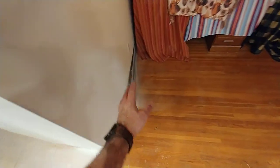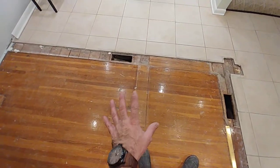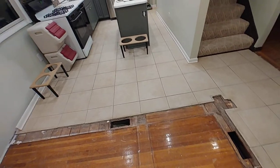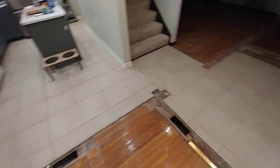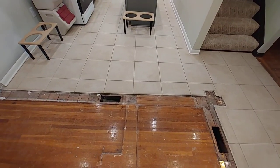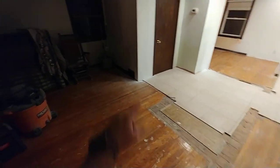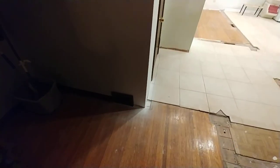We cleaned up most of the plaster dabs and overspray. This floor — even if we were going to keep this hardwood — I wouldn't have been more careful than this necessarily, unless we discussed floor protection with the customer. Rolling out RAM board, taping it all in, and spending a day installing and a day removing it adds a couple paid days, which is pretty expensive if you're not that worried. There are witness marks from the old walls, and there are areas where the finish is completely missing — little water marks and blotches. You'd do all of this working top down: paint work, get baseboard off, do the floor sanding, then polyurethane, then come back and do the trim and shoe mold all the way around.